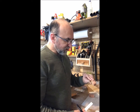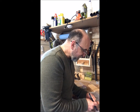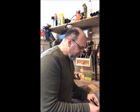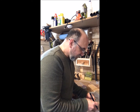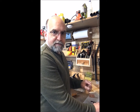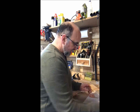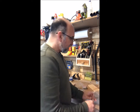The other thing that I'll do with the Celtic knot half is mark the center on both sides, so that if I drill through and I find that somehow my blank was not perfectly straight, or my drill bit wasn't straight, and I came out crooked, I'll know that and not waste my time gluing a tube into a blank that's not going to work when I try to turn it. So I just put the X on each end there.